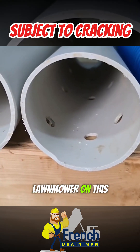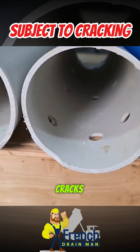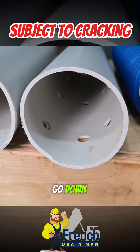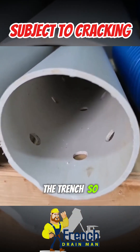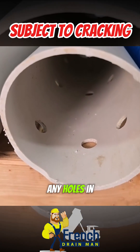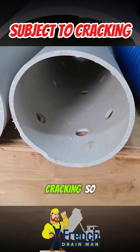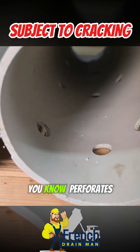When you drive a lawnmower on this pipe, you don't want it to become brittle so that it cracks. So keep that in mind. This pipe is designed so that its holes go down — the holes are on the bottom of the trench. You don't want to put any holes in the sides or the top; you're going to make the pipe too brittle. This pipe is too subject to cracking, so you just want to keep it the way the manufacturer perforates it.